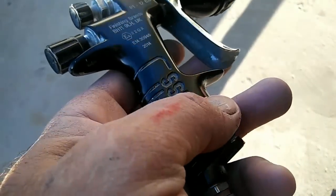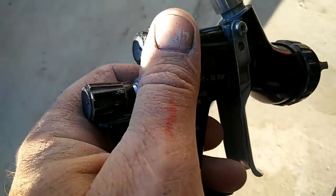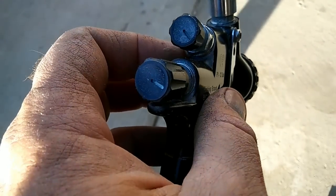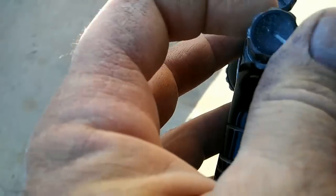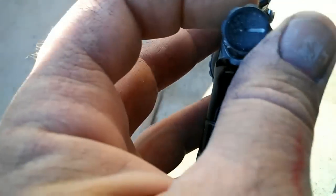If you're painting somewhere and you want no overspray, you've got to use low pressure — you can't crank these up to 29 pounds. At 14 pounds I had the fan wide open all the way. To get that smooth finish I had the material knob at zero and then backed it off two and a half turns on this gun.